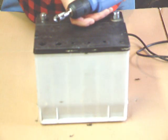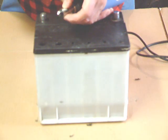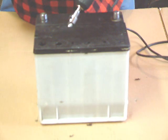Now that we've drilled the pilot holes, I've replaced the pilot drill with a half-inch stop drill bit. Remember that this drill must be a half an inch. This collar on here prevents the bit from going all the way down and smashing the battery plates. So now we'll go ahead and make these holes.